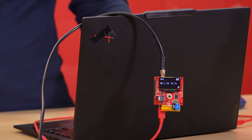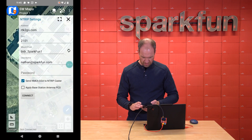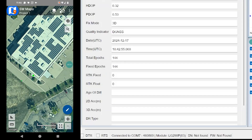That's pretty good for an off-the-shelf L1, L2, L5 receiver. The real magic begins whenever we connect over Bluetooth to the Postcard. We can see on the screen we've got a Bluetooth icon showing connectivity and can start giving it corrections over Bluetooth. We're going to connect to our base station here at SparkFun, and within a couple of seconds we should see RTK fix.